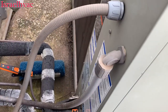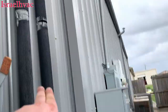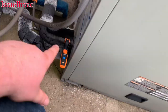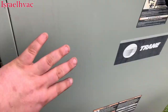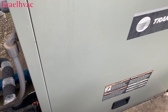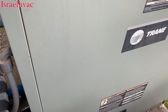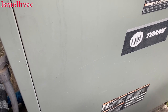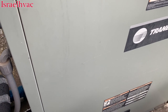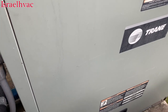As you just saw from the screenshot, I'm on circuit B. We have two 5-ton circuits — one line set here and one line set here. This is a 10-ton machine with two 5-ton circuits. This is circuit B. I've got my pipe clamps on the outside, but my pressure probes are in here in my door zone, so we're getting a true reading. We're a little low on gas — we don't have any sub-cooling, and our superheat's just a little too high. So I'm going to grab a swivel T or a core tool so I can add gas, adding a little bit at a time, then putting the door back on to get a true reading, to bring up the sub-cooling and lower that superheat.